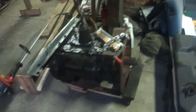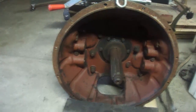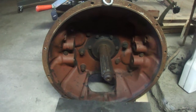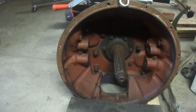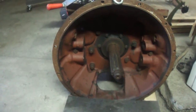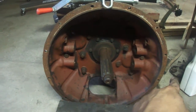A couple of things I had trouble finding information on: there are a few different options for how these transmissions are set up. First is the bell housing — you can see this is pretty big, about 21 inches across. There are three main sizes: SAE 1, SAE 2, and SAE 3. SAE 3 is typically for small setups like power units, gen sets, or tractors. SAE 2 is very common in medium and heavy-duty applications.